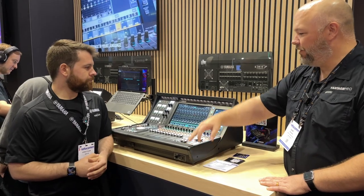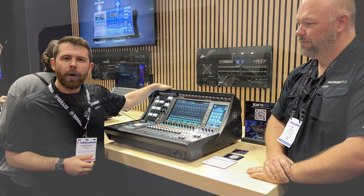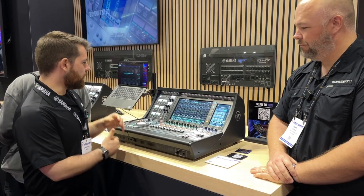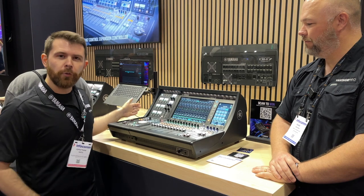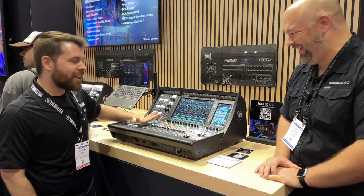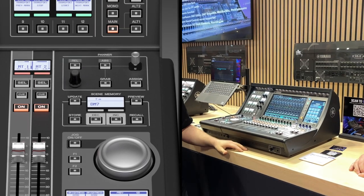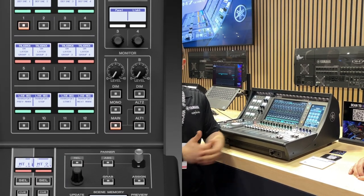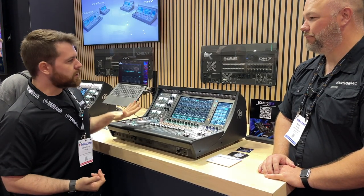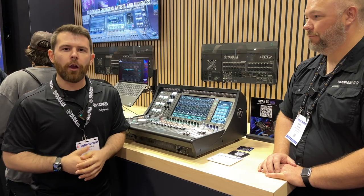We're standing in front of a Compact right now, and there's also a lovely sidecar attached to it. This is the CTL, the control module — new for Yamaha. It is control only, using a standard Ethernet Cat5 connection and an IEC for power. It offers the ability to expand your user-defined keys, user-defined encoders, as well as two user-defined faders and a jog wheel — bringing the jog wheel back from the PM1D and PM5D days. It's assignable for multiple features and can live on either side of either version of the DM7 series, or on its own. There's a two-port switch on the back, so you can connect the DM7 to the control module to your laptop running editor, all over hardwired Ethernet on a single cable.